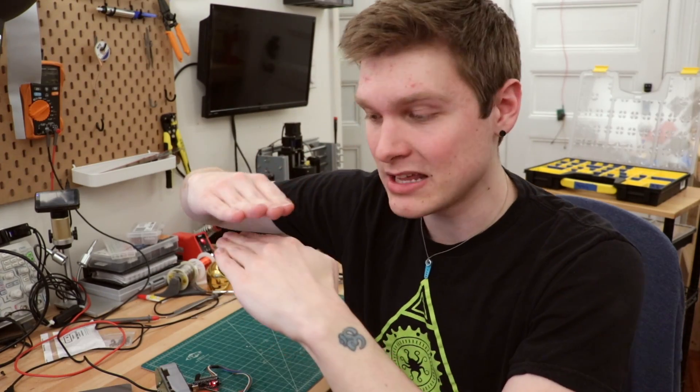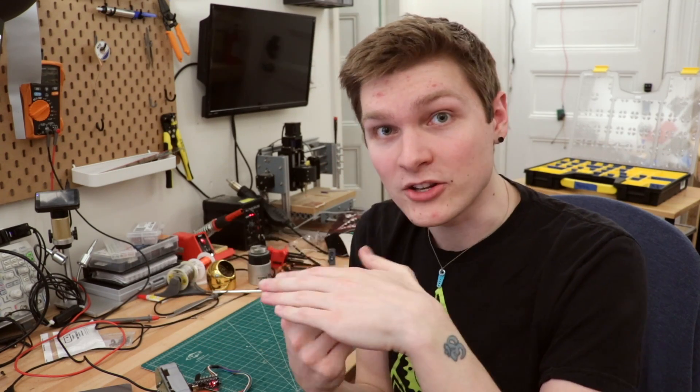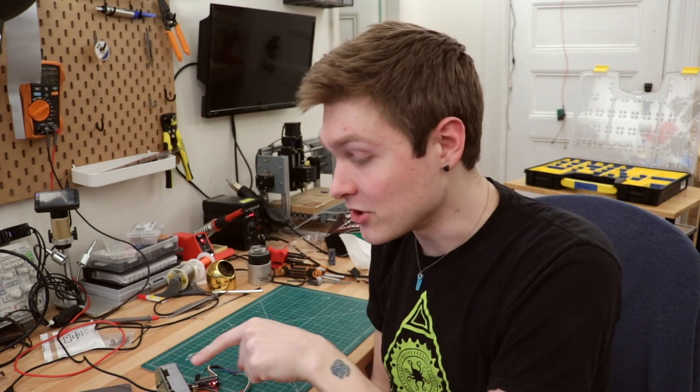Something that doesn't work is the film peeling. I was hoping that this geometry here with this FDM printed part would peel it back, but the gap between that printed blade and where the tape is constrained underneath is too big, so the film will just fold back and keep on going through. Right now I'm actually thinking about getting an X-Acto knife blade and screwing it in to the bottom side underneath this little ridge — that way there's a really sharp, clean thing that's slicing up the film and folding it over, instead of relying on a print to do that.